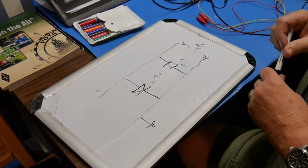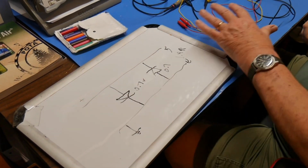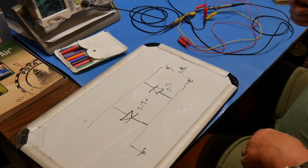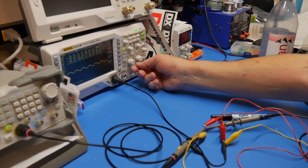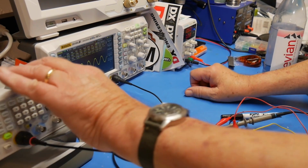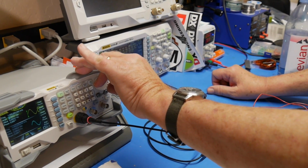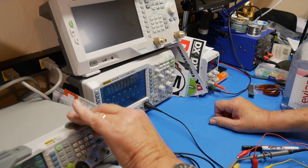And this is a very common thing that we do to prevent a large signal from coming in and damaging the front end, okay? And this really is a sine wave. If we magnify it here, we see that it's a sine wave, okay? But now, if we do this, raise the voltage, we see peaking already. That's 2 volts peak to peak.